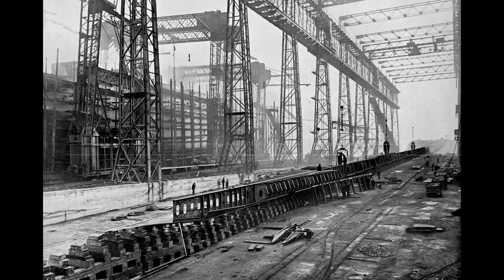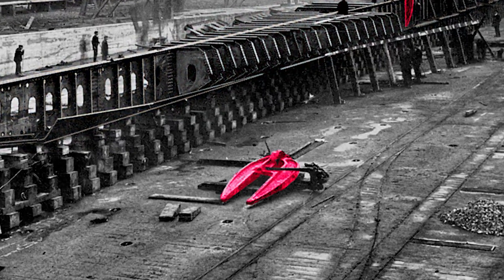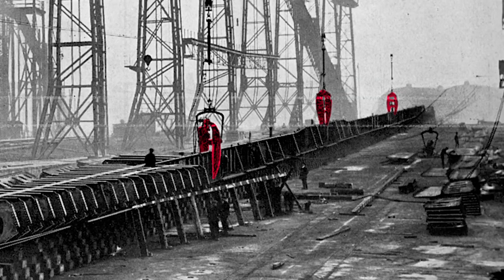So far we've watched the Olympic's construction. In the gantry, that ship sits here in the background. In the foreground lies the keel of its twin, the Titanic, whose construction began nine months after the Olympic. We see the framework of the Titanic's double bottom attached to the keel. Notice the large claw-like mechanisms lying on the ground and three hung from the cranes — these are hydraulic riveters, which workers use to install most of the three million rivets on the Titanic.